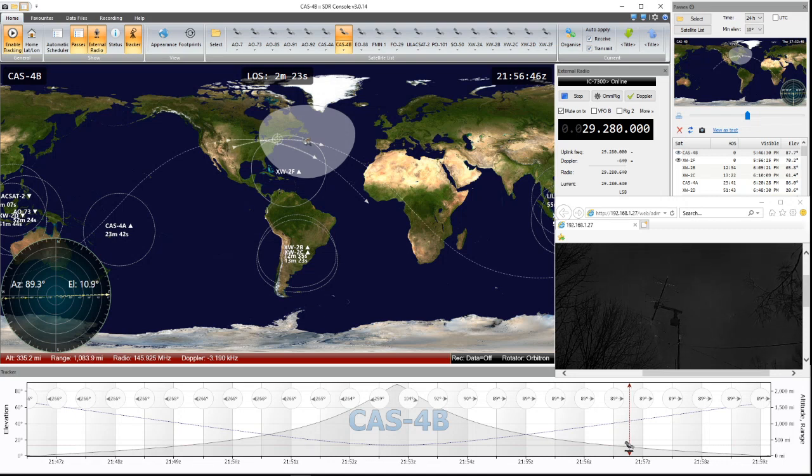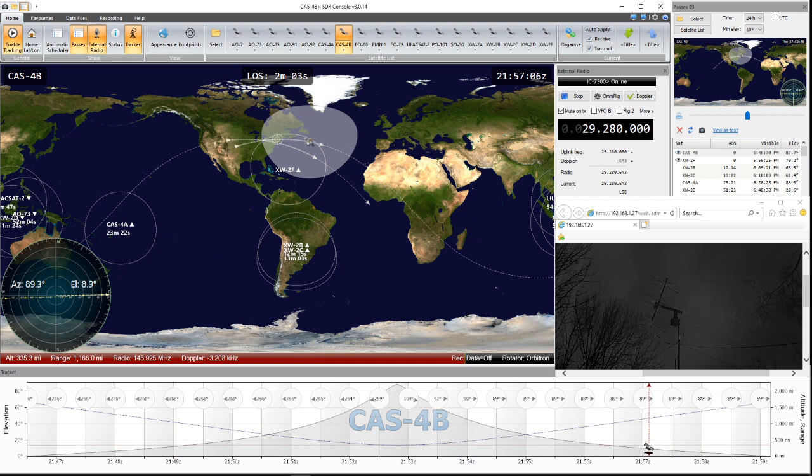However, remember: you're transmitting out of the 7300 pre-transverter, so your VFO is going to be on the 10-meter band. To cover the entire band, the transmit is going to have to be opened up because you can't transmit above 29.8 or whatever it is. So you'd have to do a TX mod — a Mars cap. If you want to use just one transverter and cover those two satellites, the SO-50 is an FM sat — that's a two-meter uplink, so you need a two-meter transverter for that one.